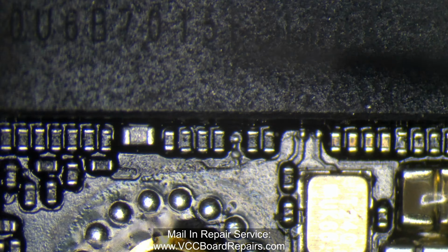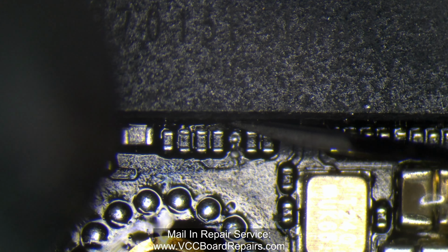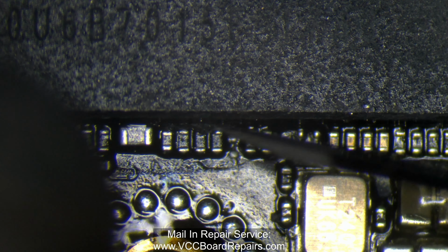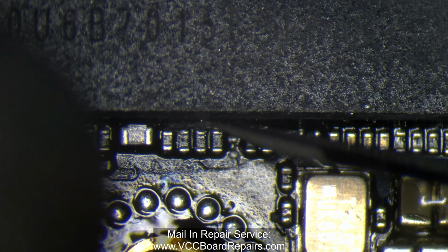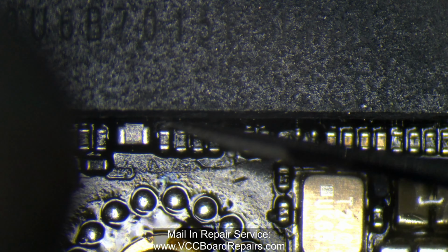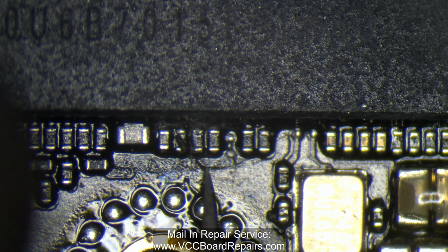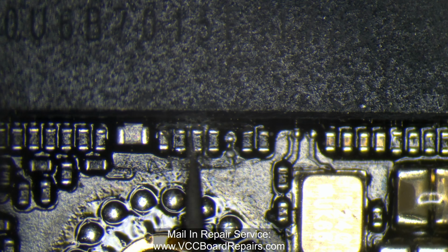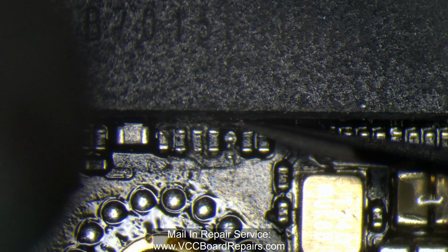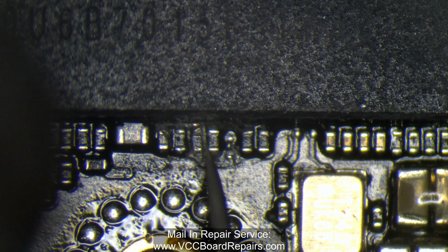So we're gonna do the same thing as before and clear the underfill. Now, I don't know if you guys can notice, but we have a different texture to this underfill. It's a little thicker, but it's still easy to manage. There's some other models that have really rock hard underfill, and it's a nightmare trying to clear it out. It's gonna be the third one, so let me clear in between. I'm using 250 Celsius, 40% airflow to clear out underfill. This is hot enough to soften the underfill, but not melt any solder. So you're not gonna destroy anything in the process.